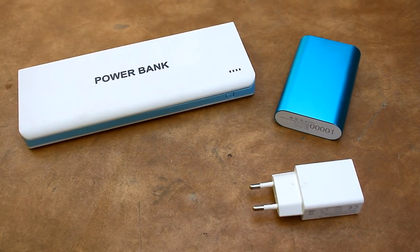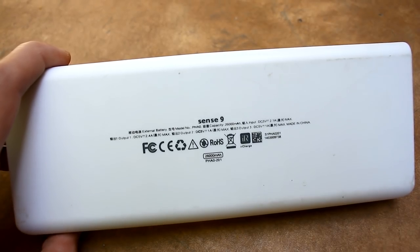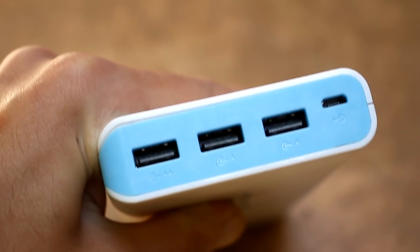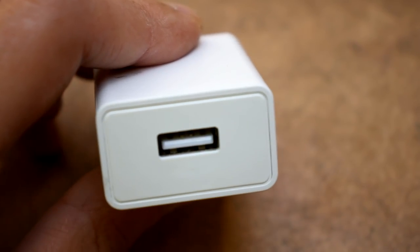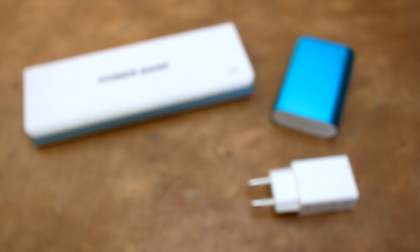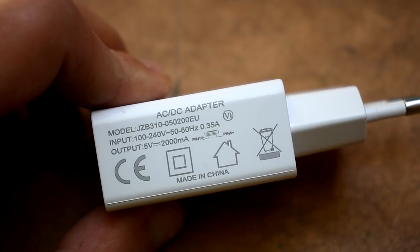Thus, if at the current declared by the manufacturer, the output voltage of the charger or power bank drops or they completely turn off, then, dead devices aren't so cool. You can also make stress tests, see what happens to your chargers during long-term operating at maximum currents, evaluate heating and work in general. So, USB load is a useful thing.